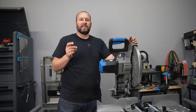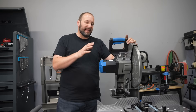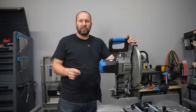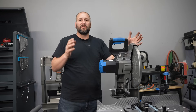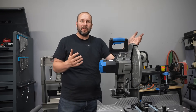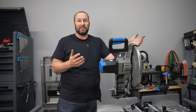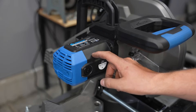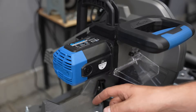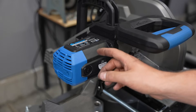Another update with this latest version is their intelligent motor. This monitors the blade speed throughout your cut to make sure it's at the optimal speed for blade life depending on how hard you're cutting, and they've found that this can extend the life of just about any blade by around 30 percent. On top of the benefits to blade life, the intelligent motor also has a soft start, which will keep you from having a spike in the current out of your circuit and prevent you from tripping your circuit breaker.